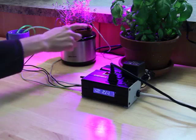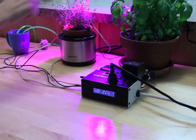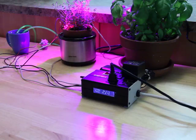The light sensor takes a running average of the light value, and if it's below 50% of regular daylight, a relay turns on a full spectrum LED light bulb. The Arduino keeps the light on for five hours before checking the average again and either keeps it on or turns it off.